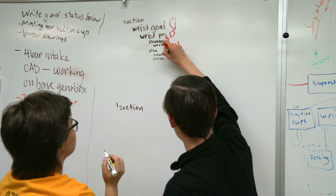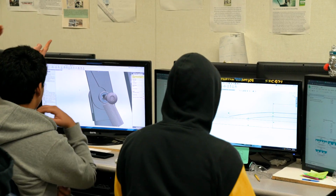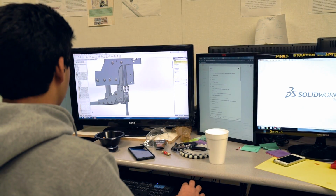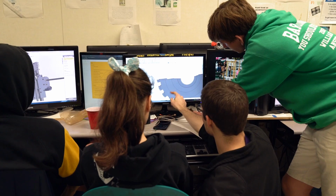Between this space here and this space here. You know, it's over-centered, so that as you push harder, it's only going to reinforce and push against that. Okay. Once we do those two things, we can come in the back here and pocket it out with ribs. Okay.